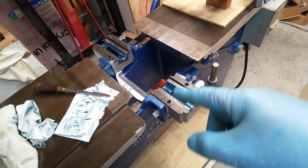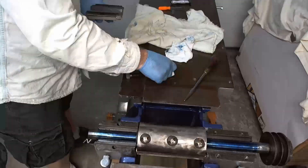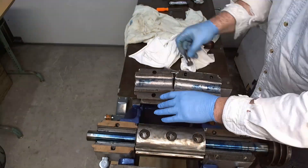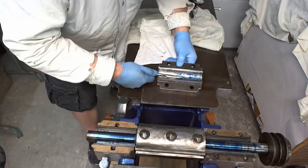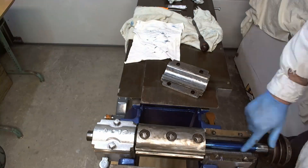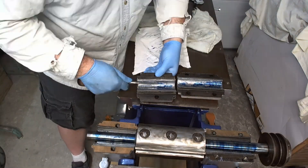Now it's time to do the caps. I blued up the top and I'm trying to not swirl the shaft around more than about three quarters of a turn, then clear that off. Initially the caps definitely did not have good coverage, but by the end they did. Each time again a little bit better, which is good.